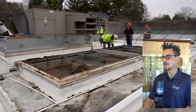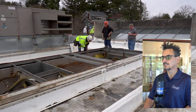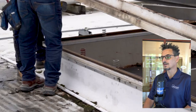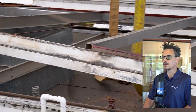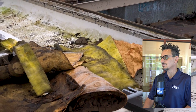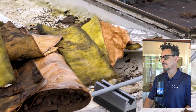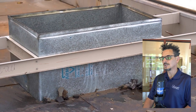Now that the existing unit has been craned away, we still have this vibration isolation rail that needs to be removed as well. You can see we're just looking around here, checking what kind of shape the insulation is underneath. Here's the removal of the isolation rail — you can see the springs in those will be removed next; we'll just pull those out by hand. The guys are cleaning up what's there, getting rid of the old nasty insulation, which is always a good idea.